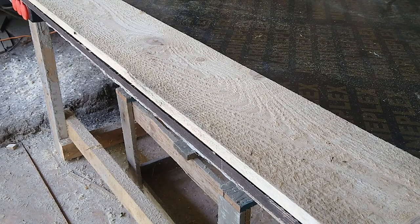One issue we do have here, certainly an issue that I've found, is getting hold of wood. If you want seasoned wood or kiln dried wood, so far I haven't found anywhere local that supplies that. So all the wood I get is basically first cut fairly green wood, which I then have to season myself before using. But you can also see, being a rough cut wood, the kind of finish you get.